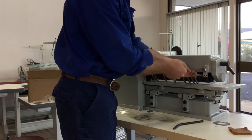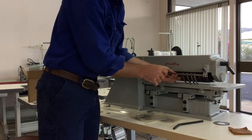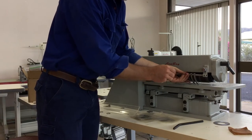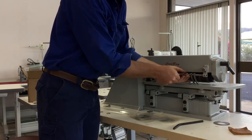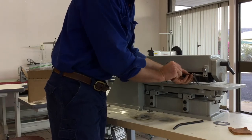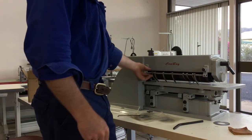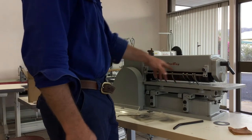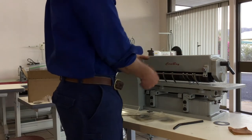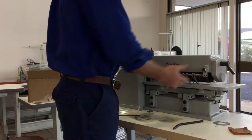Take your Allen wrench and loosen these off. These little peelers are what stops the leather from wrapping round and round the shaft, and they have to be aligned on each individual blade — they have a groove in them. And then tighten them up. If you had more blades on here, you'd put them on each blade. Obviously if you were going to cut just maybe three strips, it'd be better to have all your blades at this end, especially if you had a large side of leather. If you don't want it hanging off, the more clamped you've got, the better to secure it.